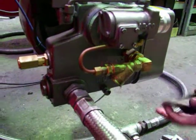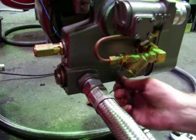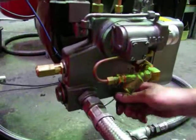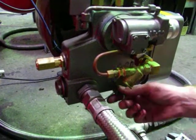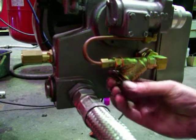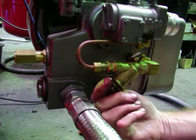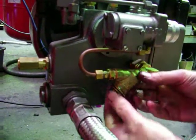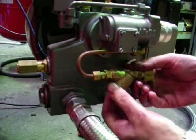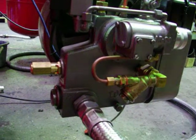Now both those filters, very important that they are cleaned periodically. How long is that period? It depends on the quality of your waste oil. Okay. I'm just going to tighten up that little stopcock on the bottom, and we'll assume we've cleaned that little Y strainer, and we'll put that back in. Okay, so that's pretty much that done. So they're the two main filters to clean in your BR10, 15 and 20 burners, everybody, when you get them.